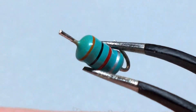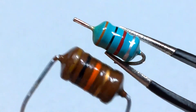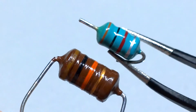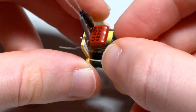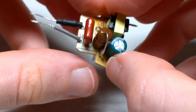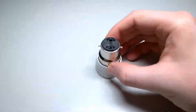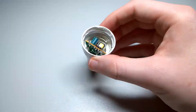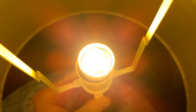The colour code on this inductor says it's a 3mH inductor rated at 10%. I had to look through my junk box and couldn't find a similar one, although I had this larger 10mH inductor — it's physically larger as well, so I reckon that'll do. I don't really know what it's rated for in terms of current, but I imagine it's probably good enough for this application. Putting it back in place, soldering it together, and putting the thing back together — not too difficult. Then I put it back in the fixture and turned it on, and we can see it works perfectly now. So that inductor was definitely faulty.